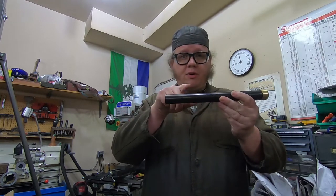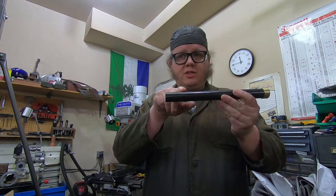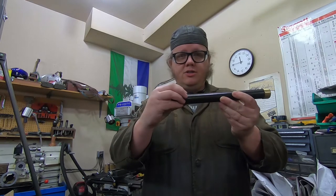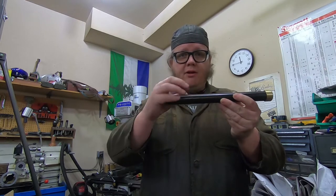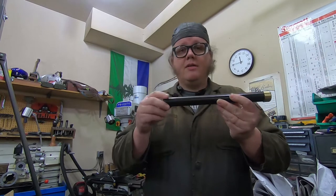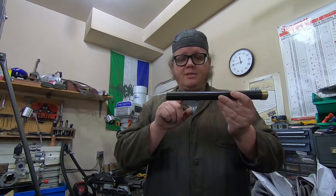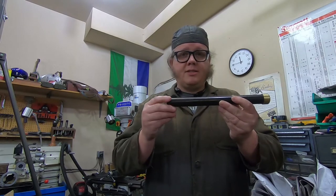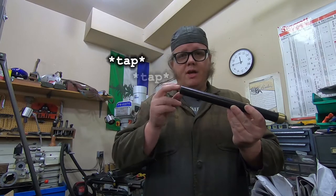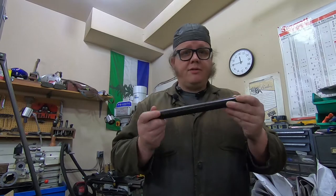Somewhere about here, I'm going to cut another aperture in the same way, and then with a quarter inch of a gap in front of it. Then I can put a chunk of steel on the inside that blocks the airflow in the same way that that one did testing last week, and use some set screws to hold it in place there. And then another adapter for the airline on the end with the valve, and we'll see how it goes.